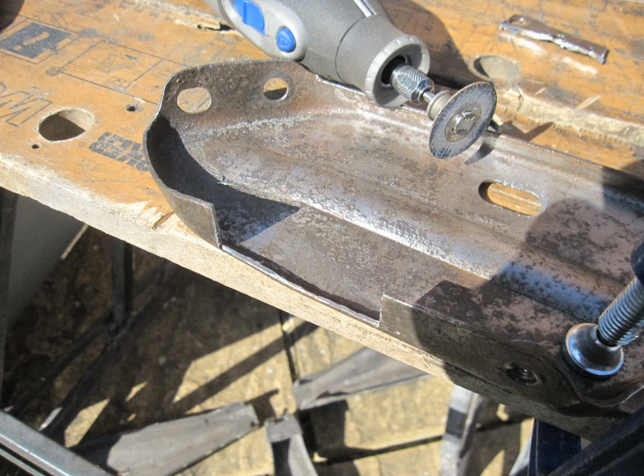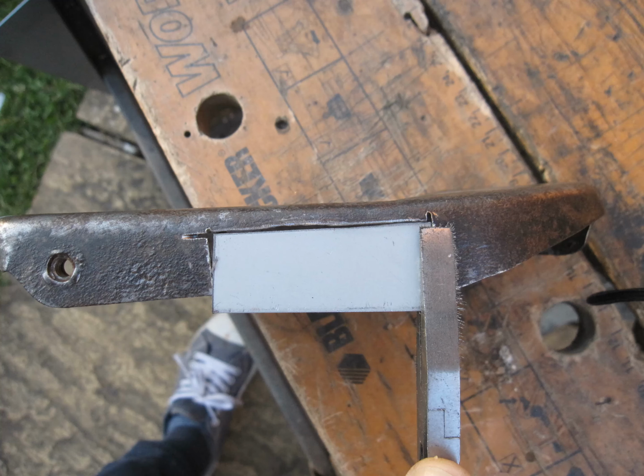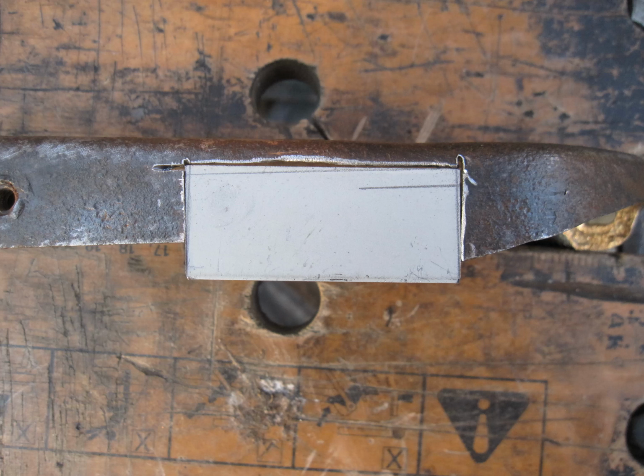The good news is 2mm metal will be easier to butt weld than the 1mm I'm normally using to repair the car. Here I've marked up a repair plate ready to cut to shape. But I reckon the gaps around the repair plate in these two places are not really close enough for butt welding. So I've had another go, which is here. This one's better.